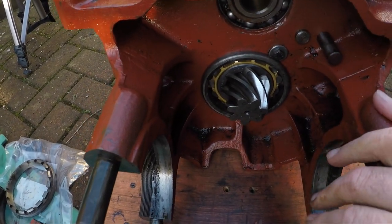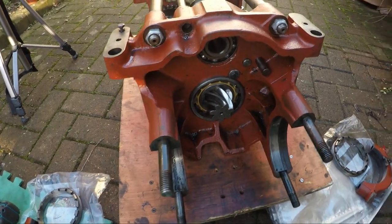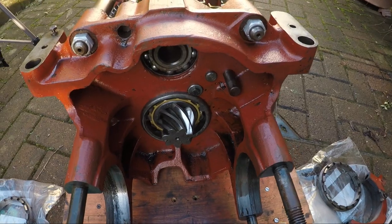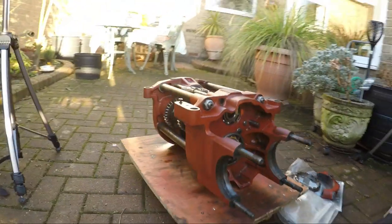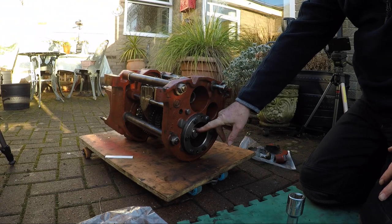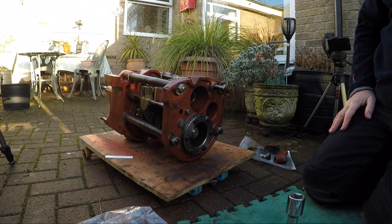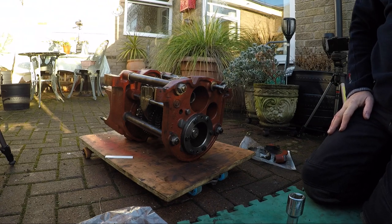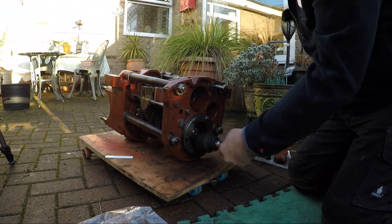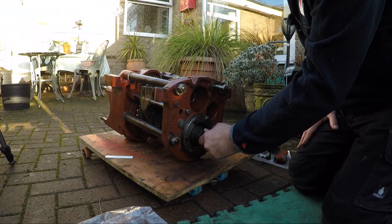You can see clearer here — the fact that this is standing proud with that screwdriver blade. The next job is to take the nut on the front of the pinion shaft off. This is inch and one-eighth UNC, I think, but it's left-hand thread. To do that we've got an inch and eleven-sixteenths socket, three-quarter drive.